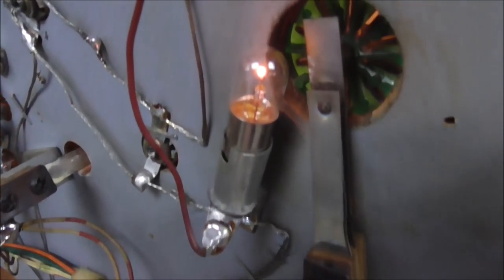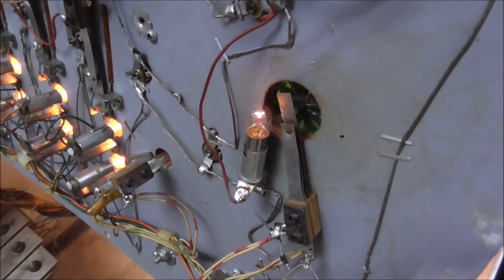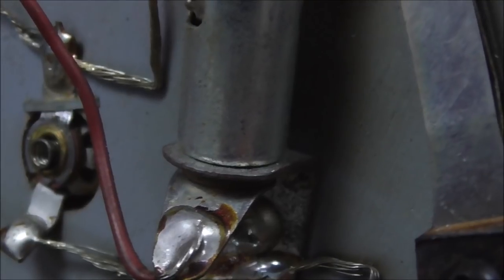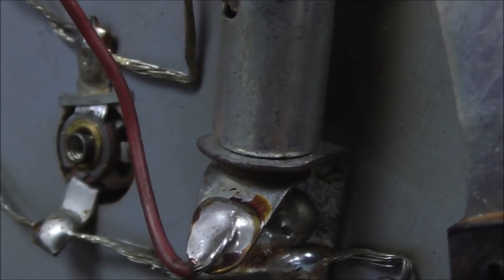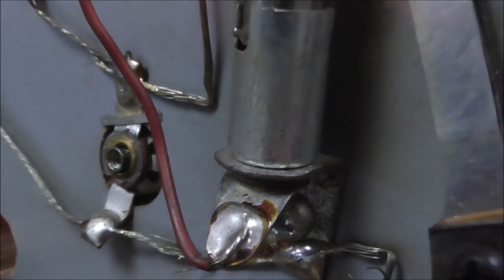Let me show you something. See how this one is working, but it's real dim? Or you might have one that's not working at all. Typically what that is, is the press fitting. See the bottom of the socket there, and how it looks like it's just fit on that little metal bracket? That's a press fitting. These things sit for years and years, and that gets oxidized, so it doesn't make good electrical contact. So the way you fix it,